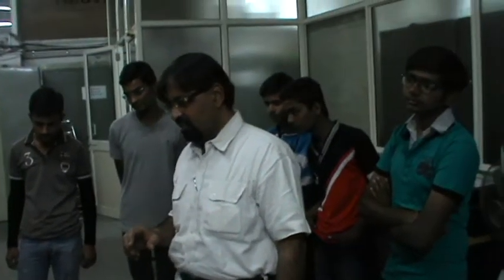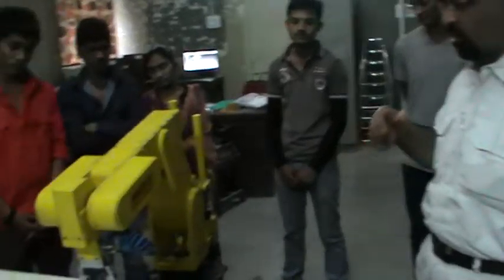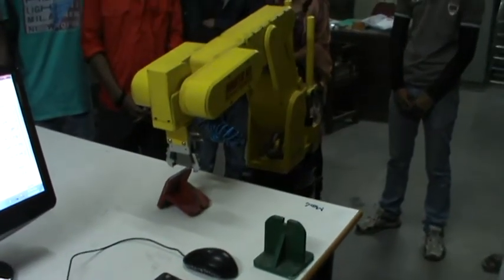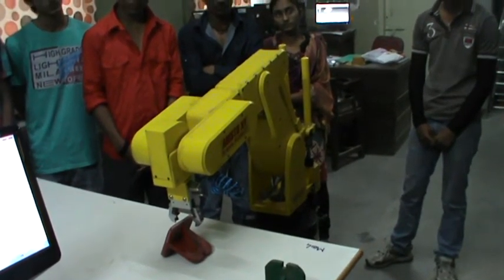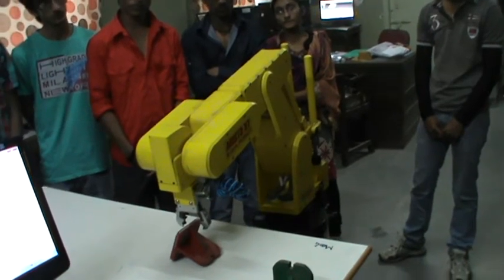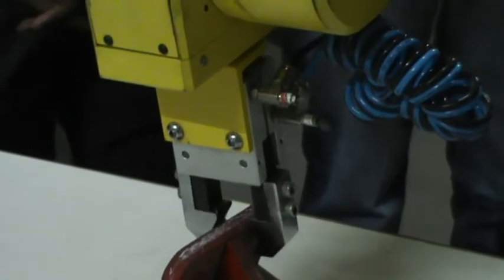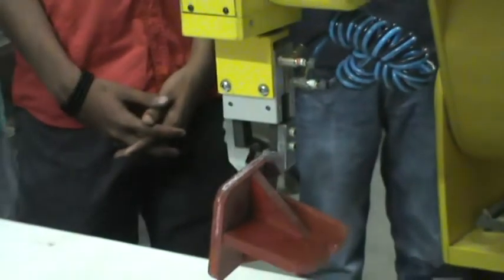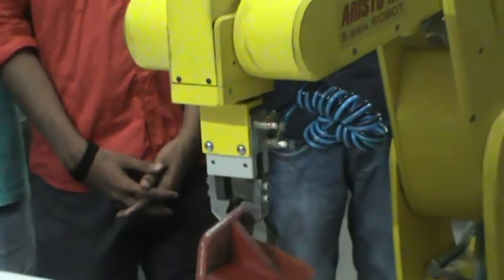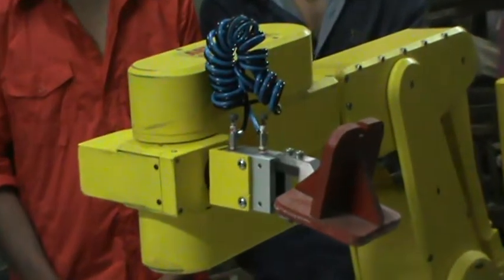You can see in industry, the job is picked and maybe it is placed in some bin or it is mounted on a machine. Here you can see there is a dummy component. It has been picked. It is positioning right now perfectly and here is a pneumatic clamping. Now the component is picked up and there is a destination fixed which we have programmed in a computer. There is a controller. The gripper is pneumatically operated.